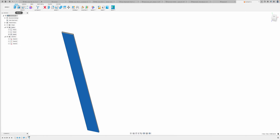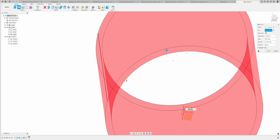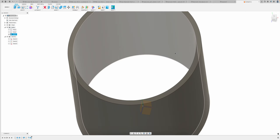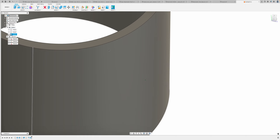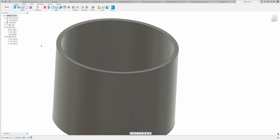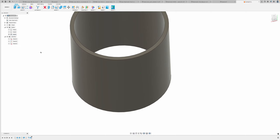Now since we have a sheet metal body, we can use the revolve tool. We select the axis and choose which way it has to rotate. Because we already created a bit of the body, it's showing red — we're not going to cut, we're going to join. After joining, we find the body already has a little seam on it because of the way sheet metal has to be created. So: body one has no seam, number two has the cut-out groove, and the sheet metal has created its own seam naturally.